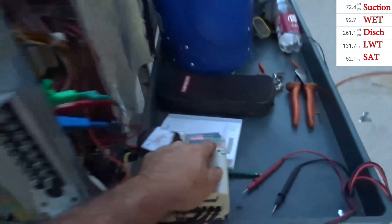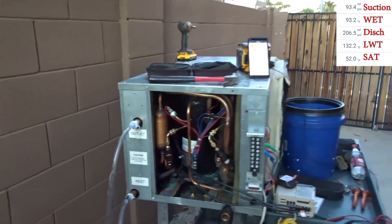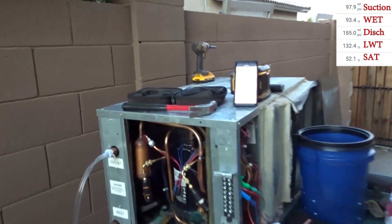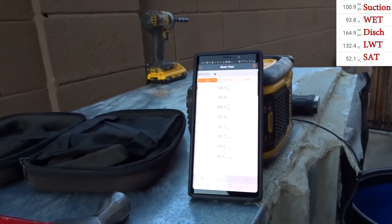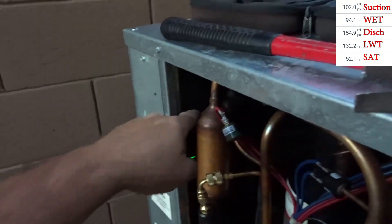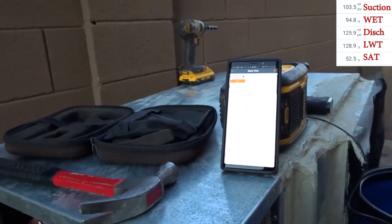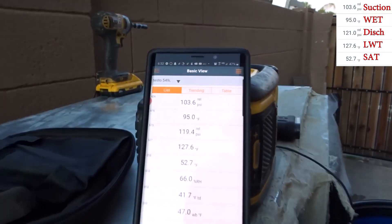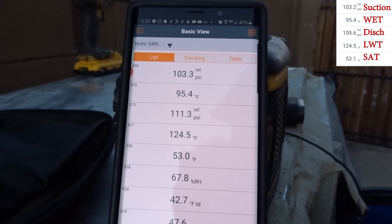The compressor stalls and there it goes - we're done. A little better test than the first time. Water temperature was up to 130-something leaving, 94 coming in - there will be a little lag being clamped on the copper. The water feels pretty warm - probably somewhere between 95 and 100 degrees right now.